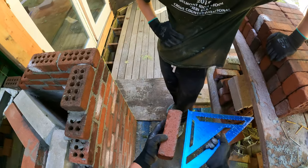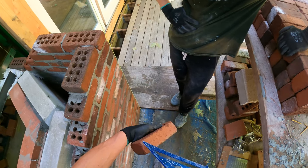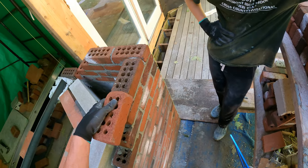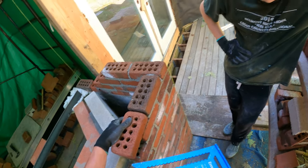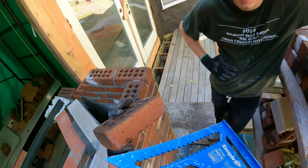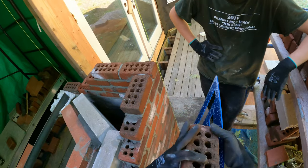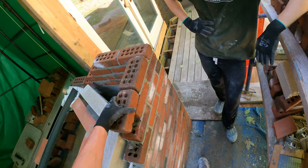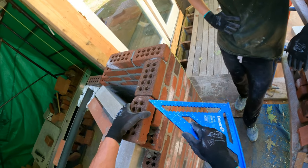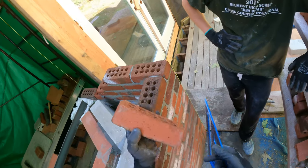Look how I'm straight. You want to lay it with this bow, with the two high points facing up, hitting the line. You don't want to lay it like this, because a lot of times it's bowing the other way. Like this one, this will be the high spot, and these will be the two low spots. If you lay it like that, it doesn't work out so well, because you're laying the middle to the line, and then these sides are going to be down. Or if you put them to the line, it's going to be high. So you want the two points.